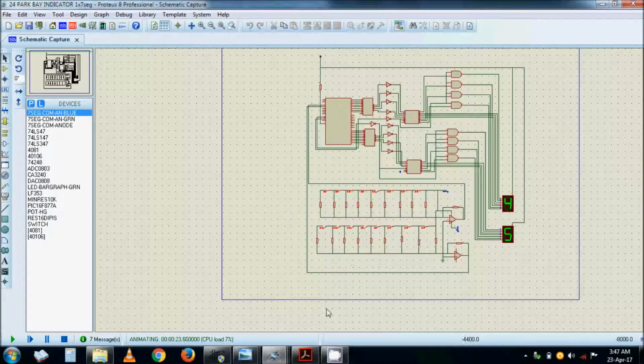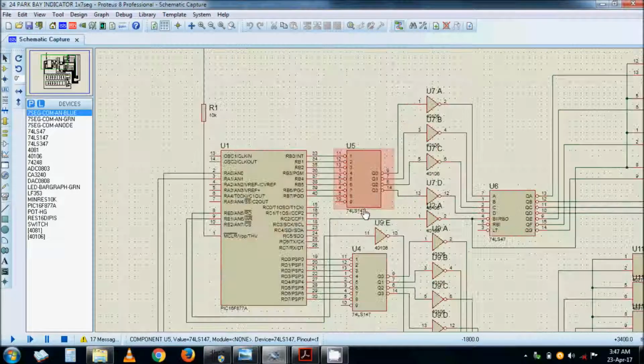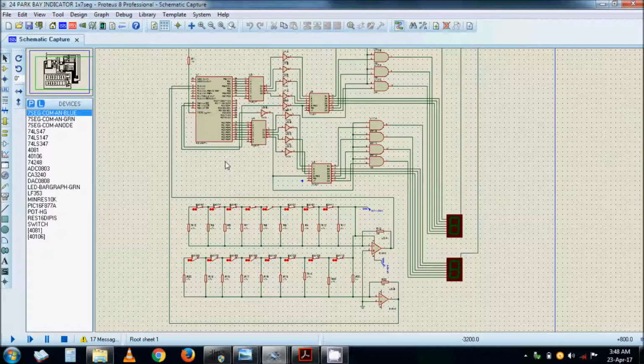You can improve it, you can change it to suit the way you see fit, but this is how it works. And one other thing that I normally would not mention on my videos is powering active components. Please power them. You must power active components. That's the electronics part that I say you must be familiar with. So these components are powered, and at what level? 5 volts for this level, you have to know that. And the 74 series ICs, also 5 volts, so you need a power supply for this. It's the 7805. Maybe you might have a 12 volt supply here, and then you put in a 7805 regulator. There is enough literature on how you power microcontrollers and ICs. These CMOS ICs you can power with 5 volts, of course, because the levels must be the same. That's the theory of electronics, and you must know that.